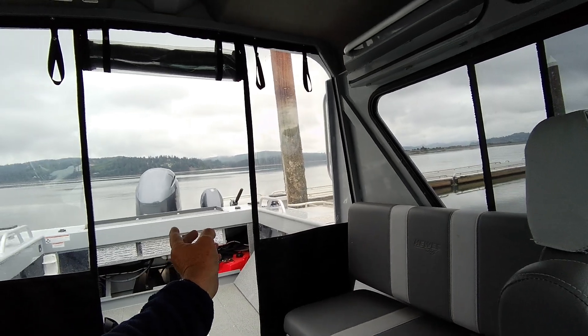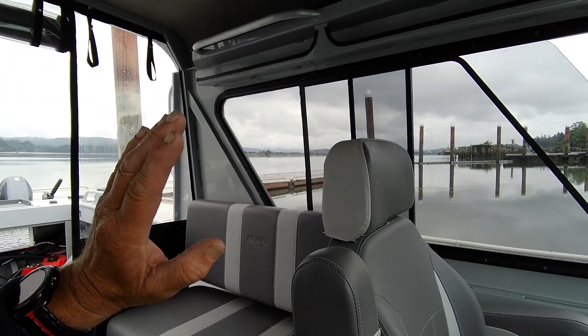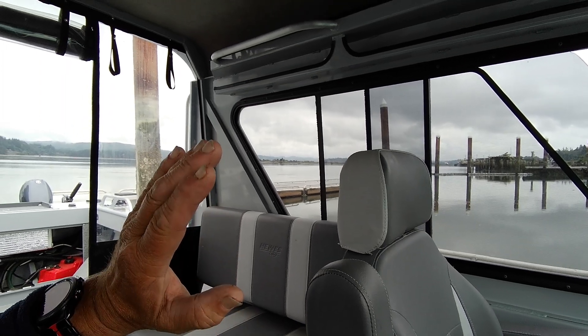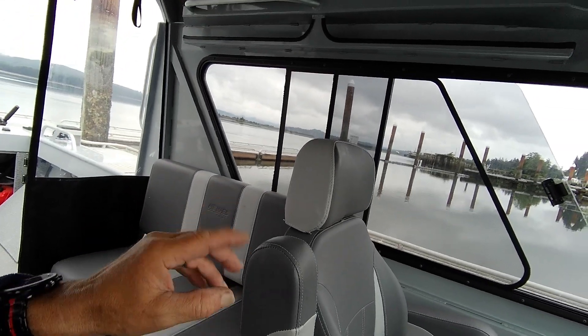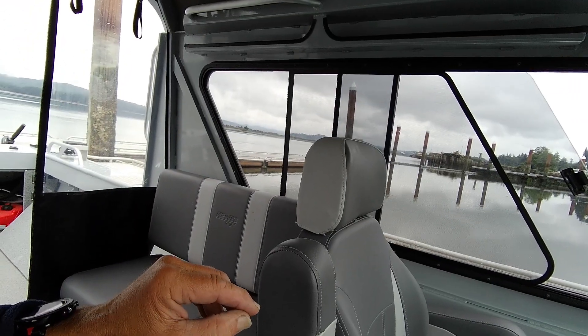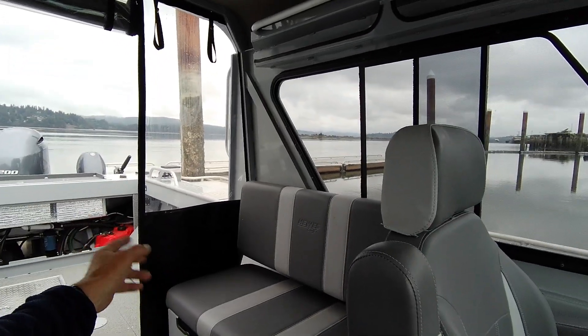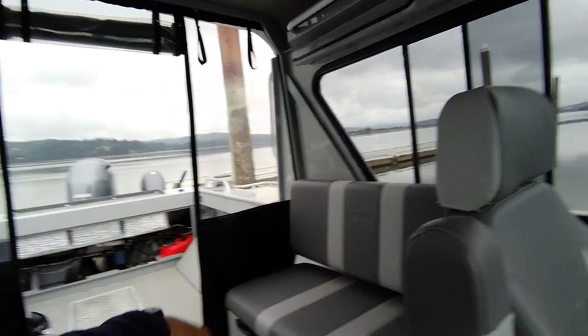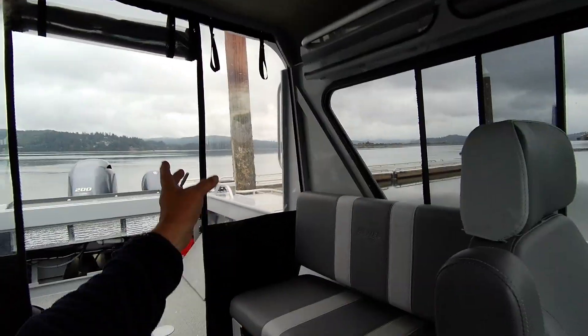Now, when you're going up, if you hit that and it goes and all of a sudden you hear it kind of slow for a second — different pitch — trim it to there and start the motor, because that's telling me your battery's weak. So by the time you keep trimming and it's still going, you've got battery power. And then once you get it all the way down to the bottom, you'll hear it go clunk — so it's at the bottom.